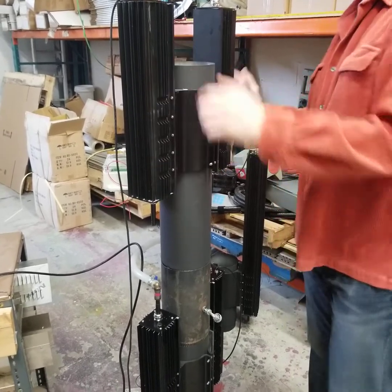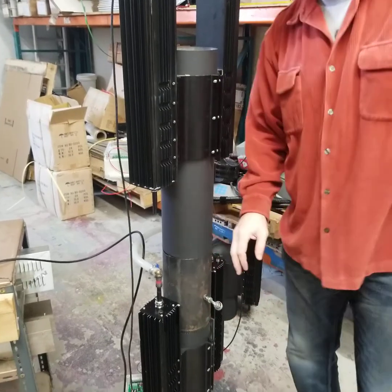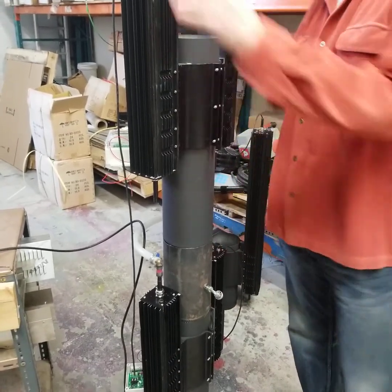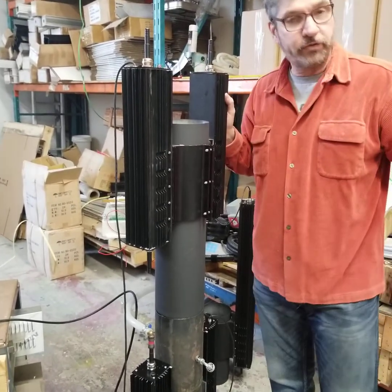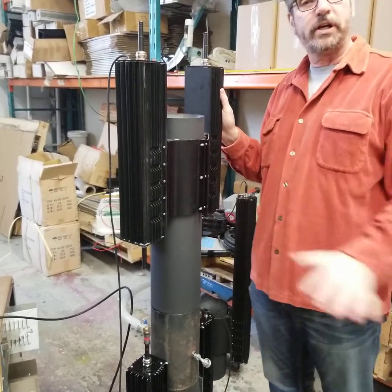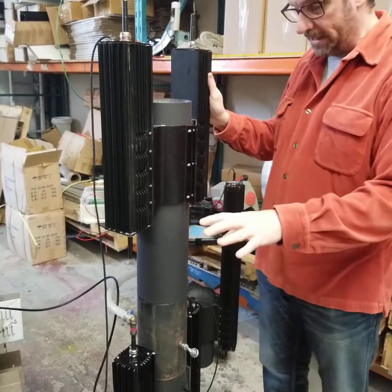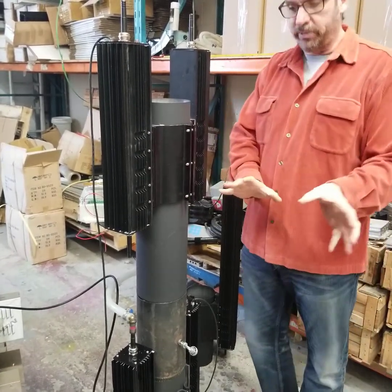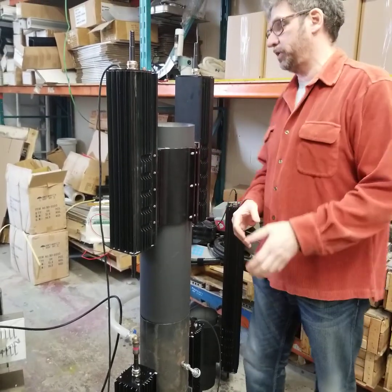At four feet above your stove — bottom to top — you now have a 220 watt nominal power output. You also have the ability to run liquid and distribute it through your house via PEX tubing. You can put it into a reservoir, dump it under the floor for in-floor heating, or use radiant heating on the side. All this flexibility allows you to operate this and run your stove extremely efficiently.